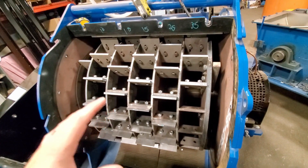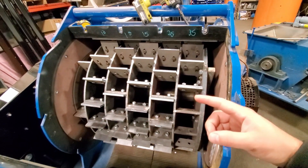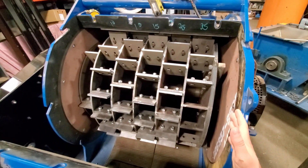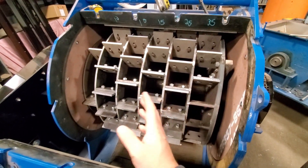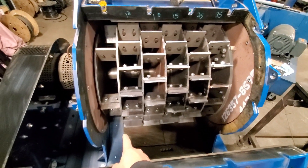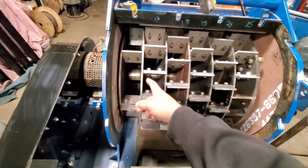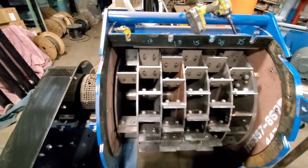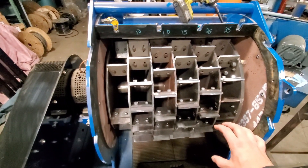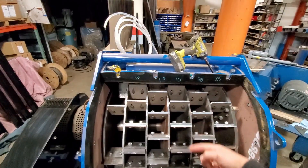With this machine, if you want the material to be smaller, you increase the rotor speed. The centrifugal force holds the material up against the edges longer, working against the blower. If you turn the machine off and put material in, it'll get vacuumed to one side. The rotor needs to be spinning so the throw blades throw the material up and the vacuum grabs it. As you speed up the rotor, centrifugal force keeps the material fighting to stay out as it travels around. These wear plates are all the way around the diameter of the turbo mill.